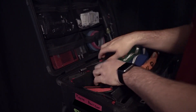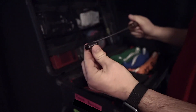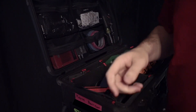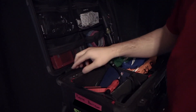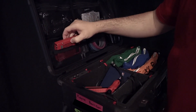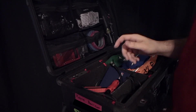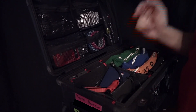Right on top I've also got a BNC tool, just in case you get into some tight areas with your SDI cable — it comes in really handy for getting those cables put into place. In this section I've got two Blackmagic SDI to HDMI converters. In the lid organizer I've got another Blackmagic microconverter as well as a Decimator MDHX. Best tool of the trade — Decimator, you can't go wrong. The Decimator is a scaler and converter; it works miracles when troubleshooting as well as just converting and splitting out signals.